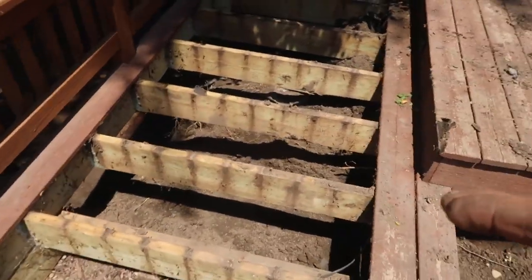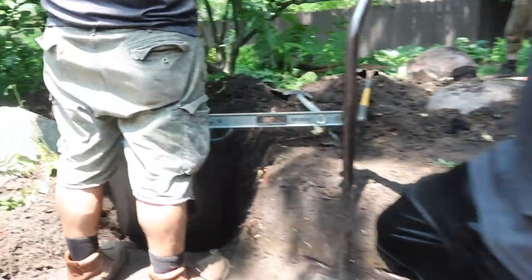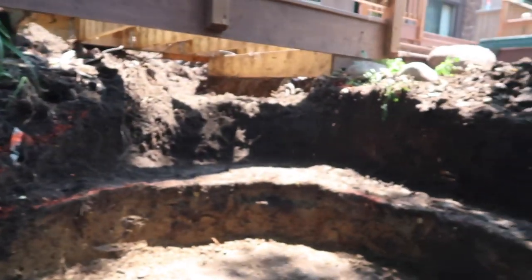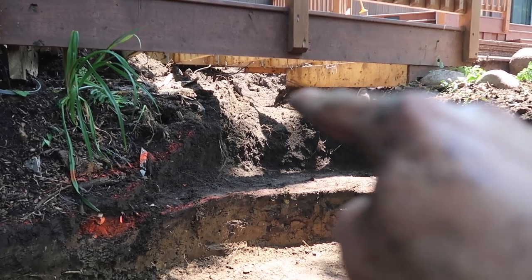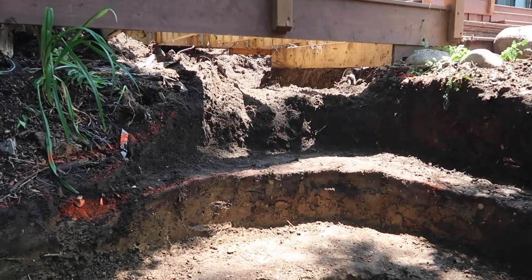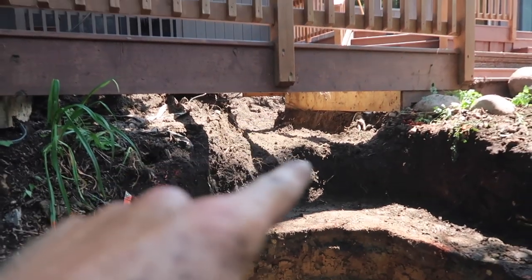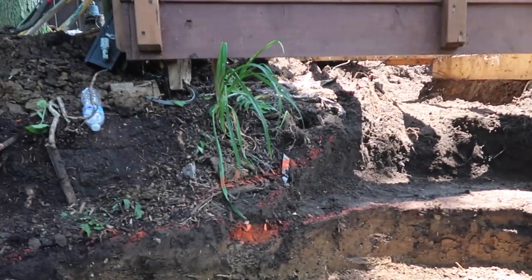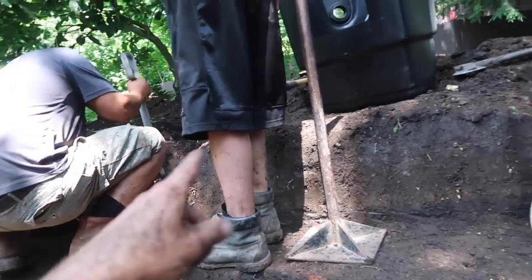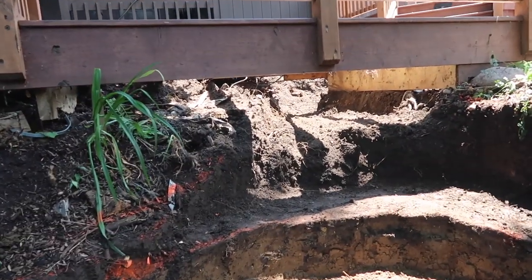Here's that area that's going to be a little bit of a challenge. We can't move the deck, we can't jack it up, we can't lower it. So we went ahead and shot water level — water level is going to be at that screw level right there. Following the camera around going this way, water level should be right around there. We are going to put an eight inch smooth wall PVC pipe underneath there and allow that water to get into this pond freely. We also have to run our two inch pipe, which is our discharge pipe going from the pump located in the skimmer, going underneath the deck and then back up to tie into that biofalls.